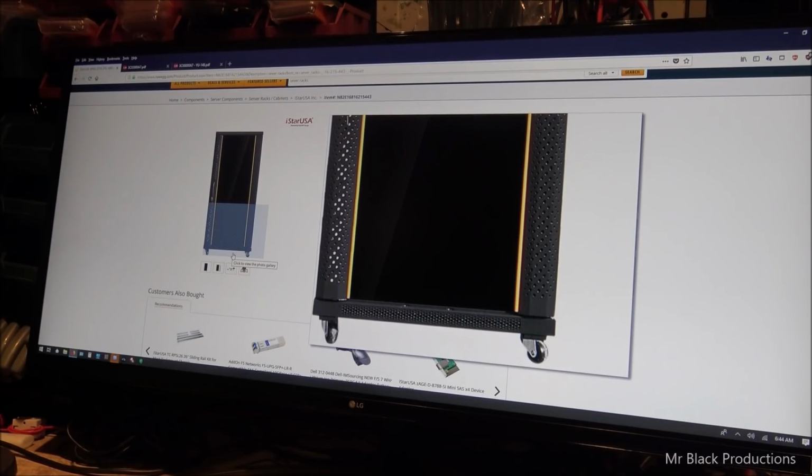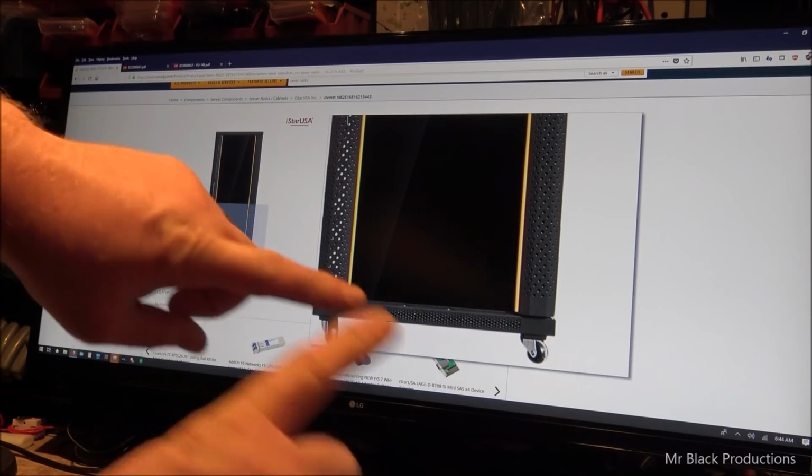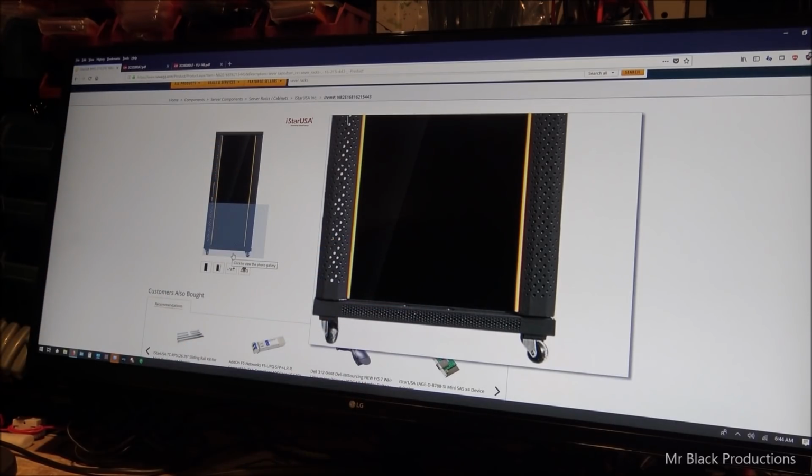So first I built a 3, then I built myself a 6. And once we get a little bit farther into the segment, you're going to see how quickly the 2 tubes differ. I think of the 6000 as a cheater tube, right? All you got to do is increase the plate voltage a little bit and back the filament voltage down a little bit, or up a little bit, and because the anode's bigger, you can make it produce a lot more power by putting more voltage on the tube.